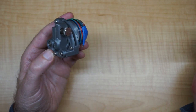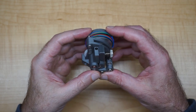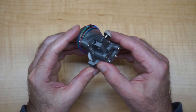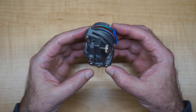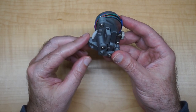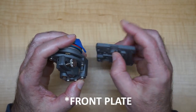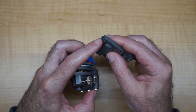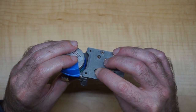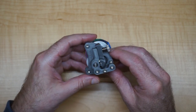So once you see something a little different, you can check out those. They can print very fast since they've got twice the number of X and Y motors moving the gantry. Anyway, this one I found, I modified it to work with the EVA system that's found on the Ratrig and other printers. So this is the one that works with the EVA backplate, which is here, and it's just got a little mod on one side so that when this is mounted, there's enough room for the little ear on the motor there. I'll show you how it's put together real quick, and then you can see it in action.